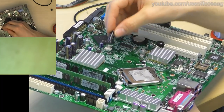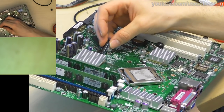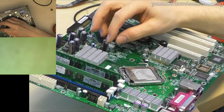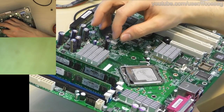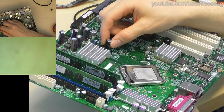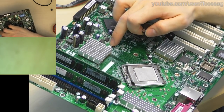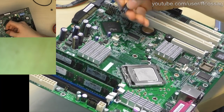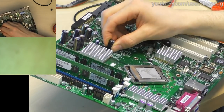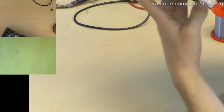With the heat-while-pulling-capacitor method, you need to be very, very certain that you have actually melted all the solder. Basically, while you're applying heat, it should feel as if the capacitor is not attached at all. You should be able to very lightly touch it and do this. If you need to apply any force to the cap and the solder hasn't melted all the way, you're going to do that with a bit too much force, and you're going to pull the wires through. And if those are connected to a middle layer, you're fucked, your board is done. There's no recovering from that. But with some skill and practice, you can tell when the solder's actually melted.